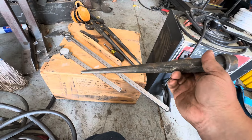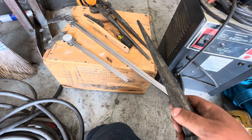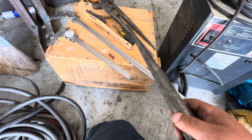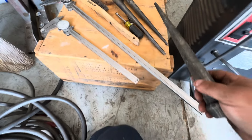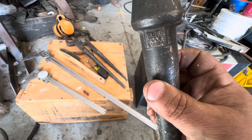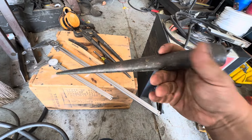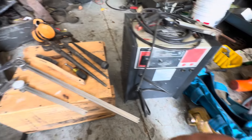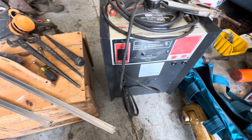This is the thing I was most excited about. What I use this for is — when two flanges are misaligned, you put this in there and whale on it with a hammer to get it to where you can get the bolts in. If you have to drive a flange that much together, you take a rosebud on a torch and heat the metal so it relaxes. You never put a pump under strain like that because of the casting. This is like downstream retrofitting a valve into a couple of spool pieces. This is a Klein flange spike — they go by a million different names.